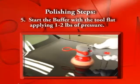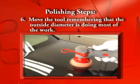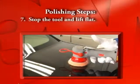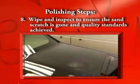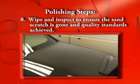Start the buffer with the tool flat, applying 1 to 2 pounds of pressure. Move the tool, remembering that the outside diameter is doing most of the work. Stop the tool and lift flat. Wipe and inspect to ensure the sand scratch is gone and quality standards achieved.